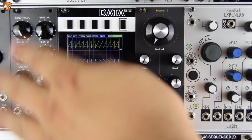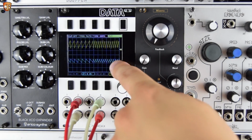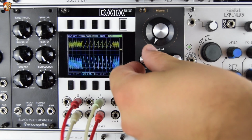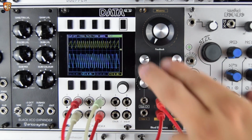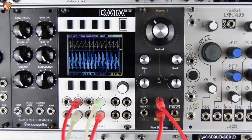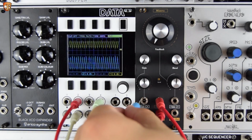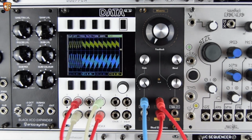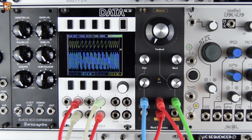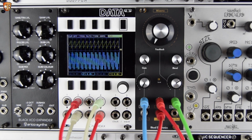So now we're going saw wave straight from my oscillator into Miasma. As you can see, the input signal never dips like it did before. Out of this, that's the blue trace, just if you want to see it. And that's then going into my filtering and amplitude control. So that feedback's now been chopped in and out. Let's try modulation again. Same sequence to gain CV. Again, let's invert it. And accent to feedback. So it's a very different response.